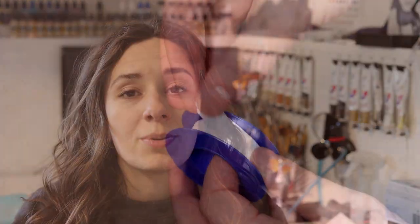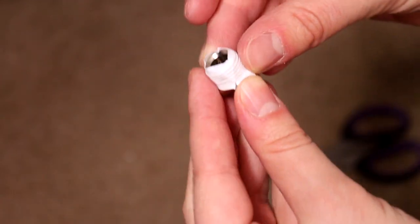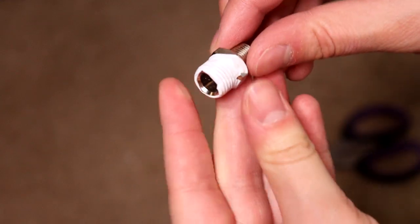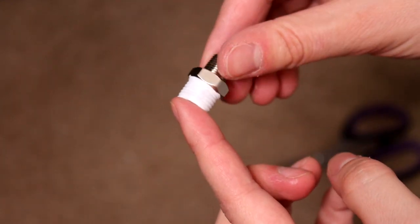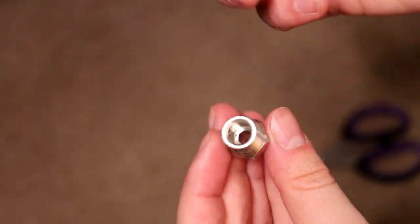For all of these connection points you are going to want to use seal tape to seal all of the connections. Air at high pressure wants to escape, so anywhere there is a connection point or a thread, use this seal tape. It's super easy — just cut off a little piece, stick it on the thread, screw in the part, and use as much as you need to so you can't audibly hear or feel any air escaping. It's not actually sticky — it's more like a plastic with a static cling that you can wrap onto any thread. Just make sure the opening hole where air runs through is not covered. If the compressor keeps running, it means there's a leak somewhere. As soon as I added the tape I could no longer audibly hear any of the connection points.